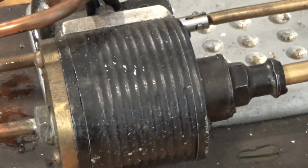I made the piston by hand by putting it on the table on the drill, you know, the bit you put the work on, and putting a dial gauge on it. And I went round and round and round it by hand with the dial gauge on, and I got it within 3/10 of a thou.